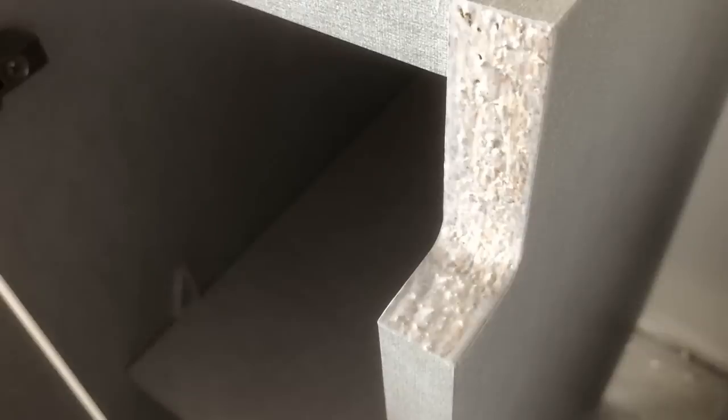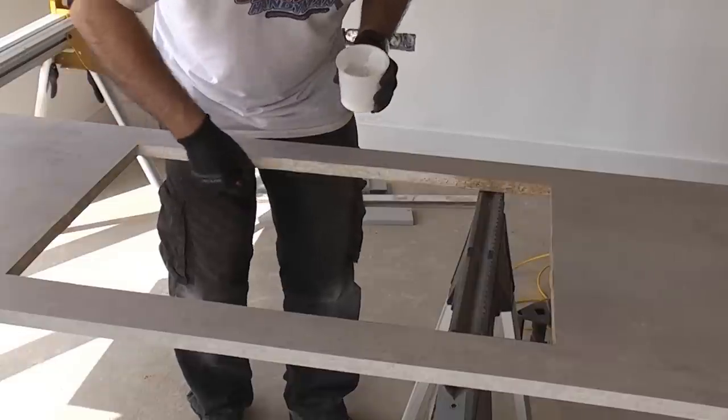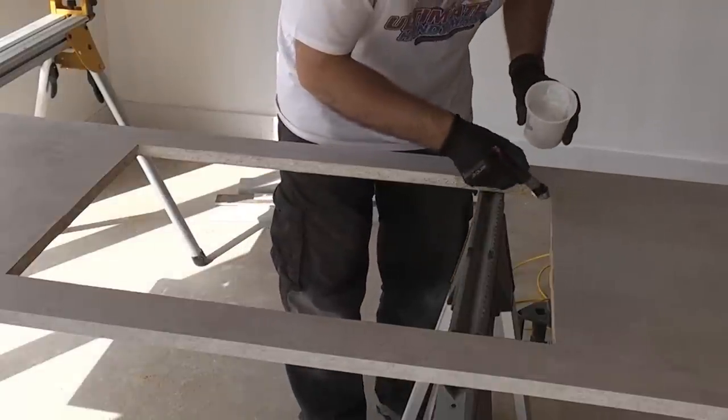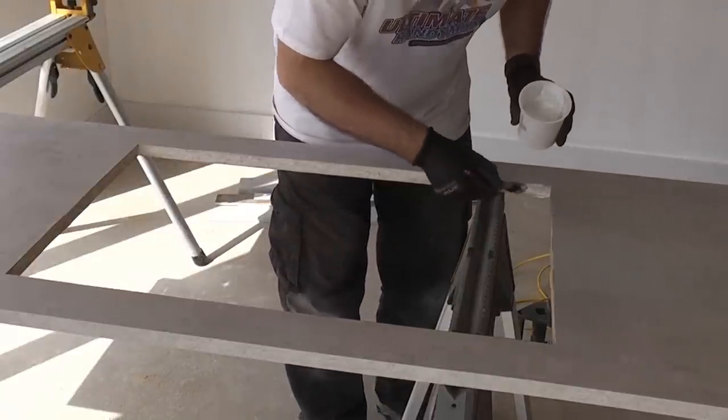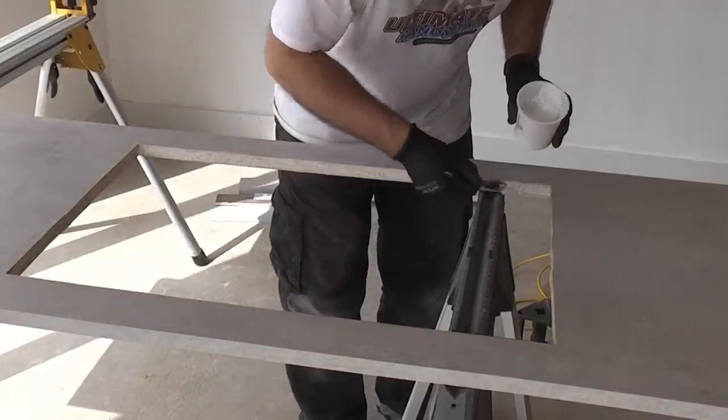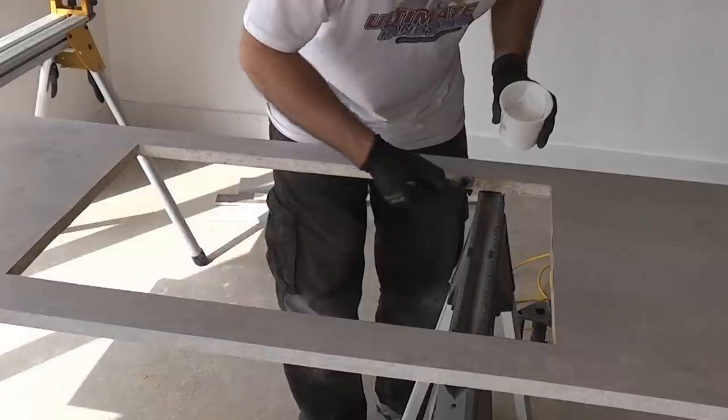For this reason, I even sealed the front edge where the handle trim is situated, as you only need a child to spill a load of water onto the worktop and it can completely ruin the units. For sealing the chipboard, I normally use external wood glue and paint it on using a flux brush or similar.